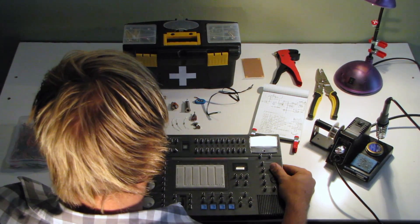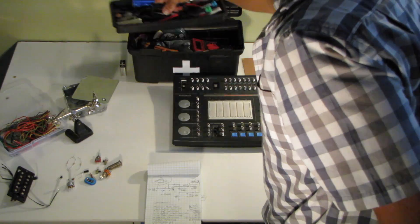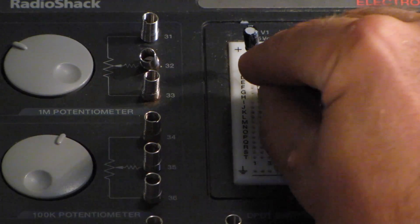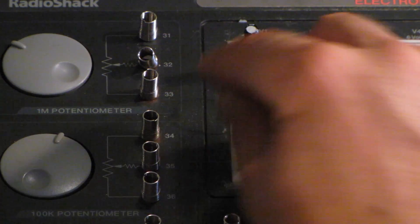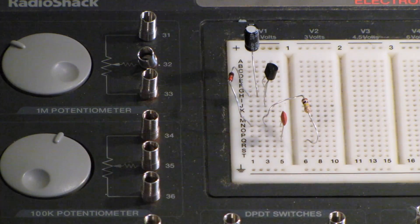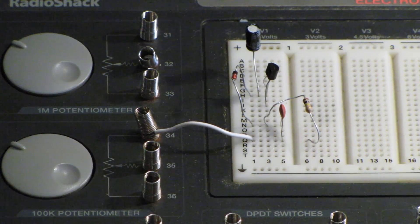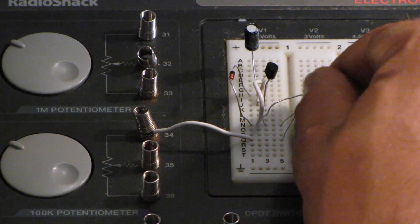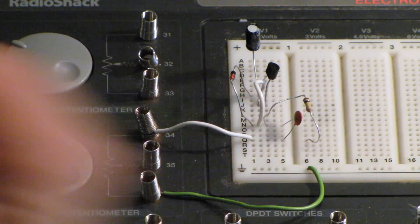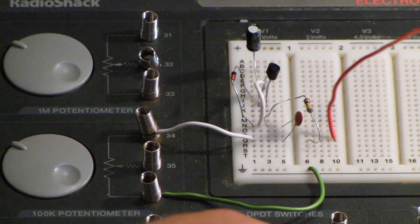Don't forget your colorfully assorted and carefully organized set of wires. Right here I'm putting in a capacitor and then a transistor — this is just a basic prototype, so feel free to experiment. There's a diode over there, resistors and a capacitor I'm going to hook up to the pot. I like to do this before putting anything in the strip board because it lets you experiment without having to solder yet. This wire is going to go to the power source — nine volts, so we'll just use a simple nine-volt battery.